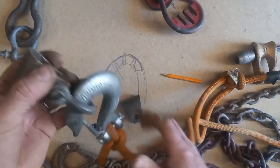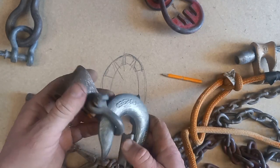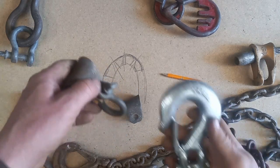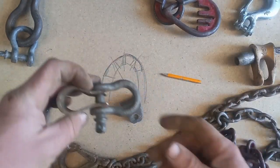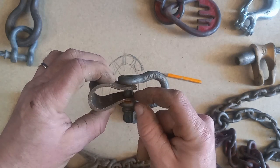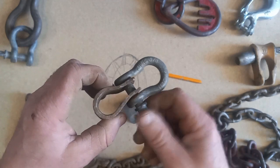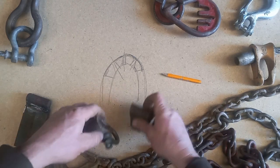You can have five or six of these to clinch all those tops and cluster them together. You could also use a regular grab hook or a latch-type open grab. When you're shackle shopping, the bigger the opening on the shackle the better, because if it's too tight you'll have to crunch the choker down and it'll be a pain to slip onto the cable. You want these to be easy to take on and off — they're consumable. Just be careful not to suck them over to the fairlead, because they'll jam up in your winch.